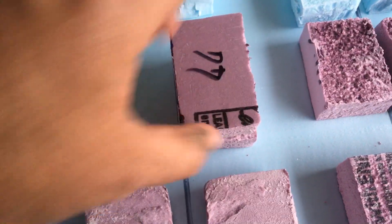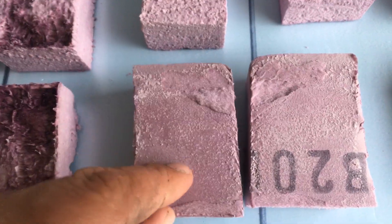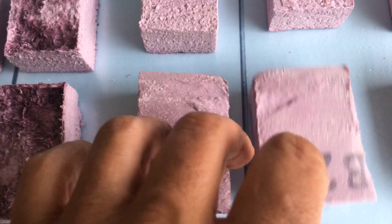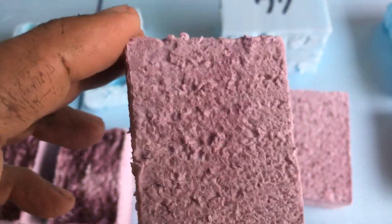I have two different pink foam samples because I glued different surfaces. This is the cut surface I glued together and this is the factory surface. The factory surface adhesion test held fairly well — that's the 3M Super 77. It held better on the smoother factory surface. The cut surface is rough — I thought that would be good because there's more surface area for the glue, but it did not hold as well.